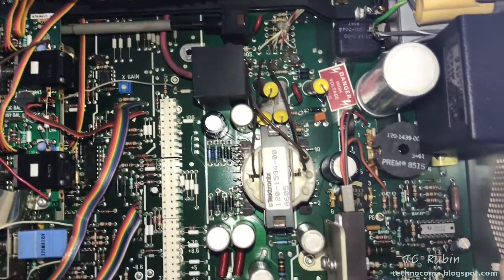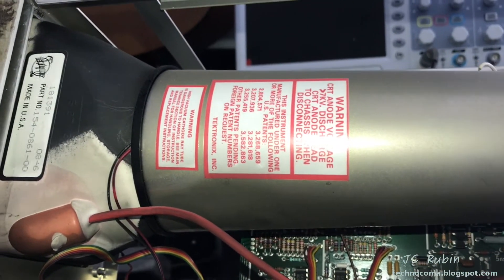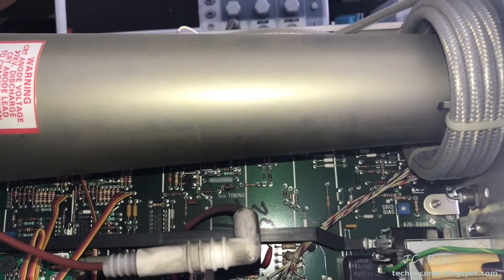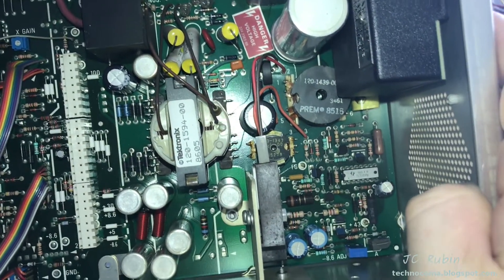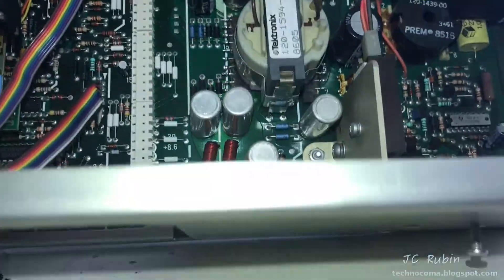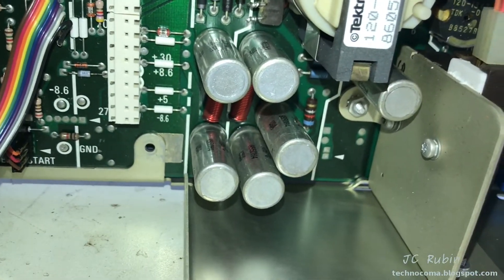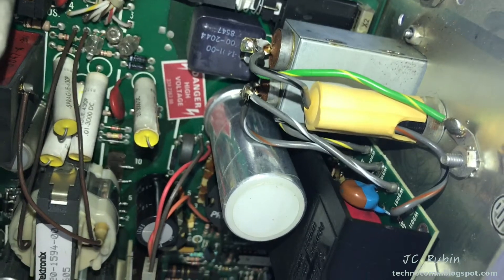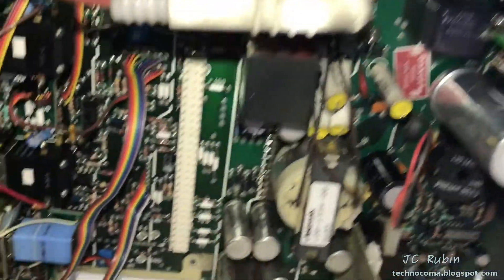Aside from the problem, which I'll demonstrate once I power it on, there are no other obvious issues. There's no power supply problem with the CRT — all of the other functions work fine. I'm making assumptions here, but the issue I'm seeing doesn't lend itself towards a power supply problem. That said, there are a lot of original electrolytic capacitors here. While I have this open, maybe I'll take some ESR measurements — multi-can ESR measurements too. If I find a smoking gun here, I could stop and evaluate, as I do with every other project.